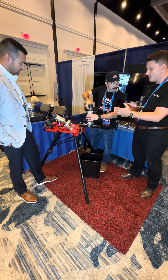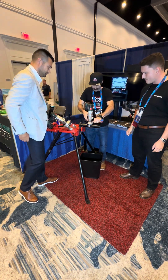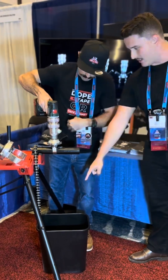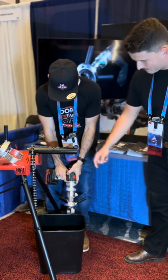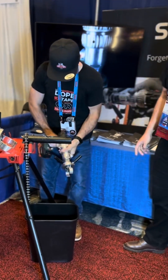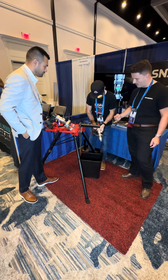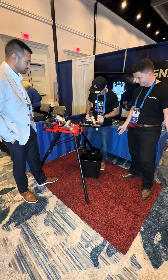Now we're going to drive this back up. No — you remove it from the pipe. You never want to return it on the pipe. Remove it from the pipe using the handle. Take the machine off. Point it at the bin. Give it full feed and reverse to kick the bit out. All the way forward on the feed, then return on the drill.